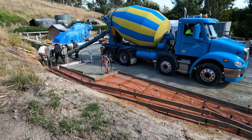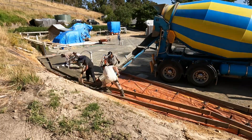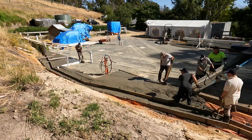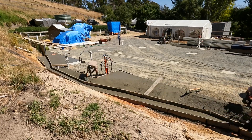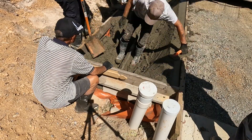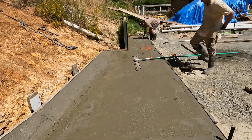The truck arrived — it's about five and a half cubic meters of concrete. I decided to go with 25 megapascal concrete. It was quite a hot day, nearly 30 degrees, and because of the slopes it was a bit more work than expected. Finishing it was a bit of a challenge so it took a bit longer than expected, but it did turn out well — the slope was right. I was exhausted to be honest, and finishing it became difficult as it started to set off.